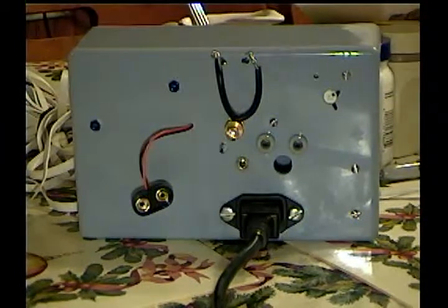It has battery backup — a fairly simple but effective battery holder. The nine-volt snap battery can be used two ways: to operate the unit portable while walking around, or wherever you're going to put your sensor. The sensor will probably need to be about 20 feet from any television or computer monitor, and about the same distance from any microwave or other major appliance.